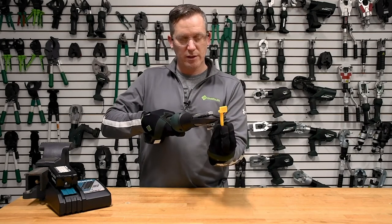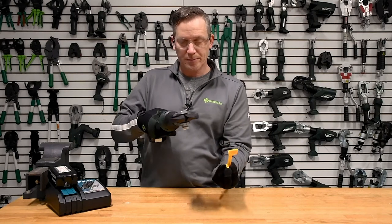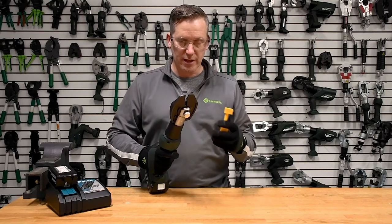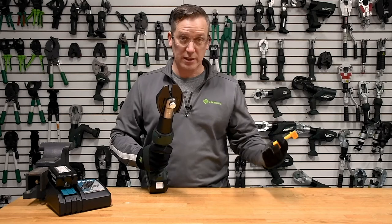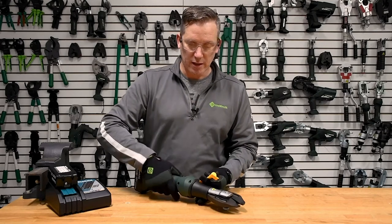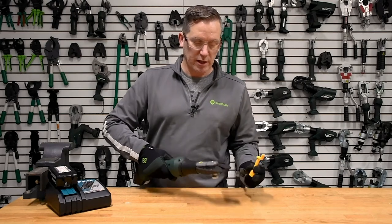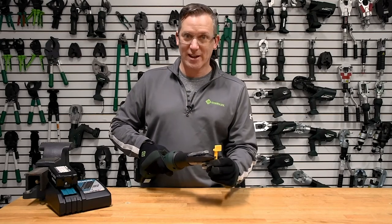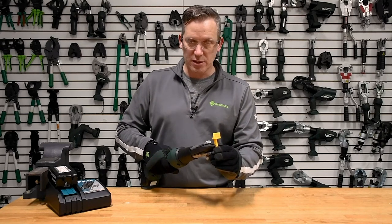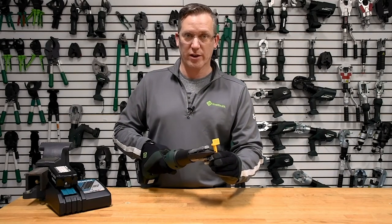The safety seal will sit here, and the jaws will wrap around it with a very short profile. When cutting into a hard material like this, a lot of energy is going to be released. The jaws work in a snap configuration — not a scissor action — so keep your face and hands away from the jaw as it's doing its job. We'll run the tool up to seat the seal in the jaw so it won't fall out, then move the hand clear before carrying out the demonstration.